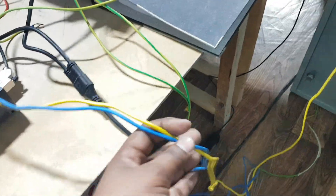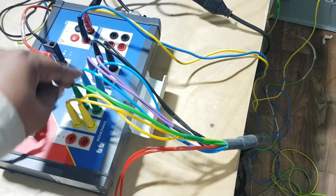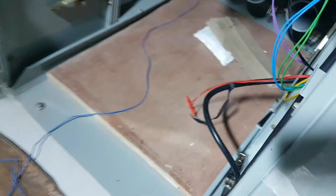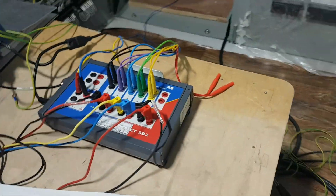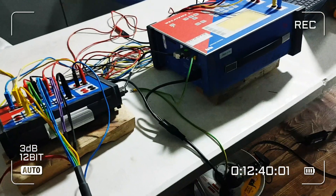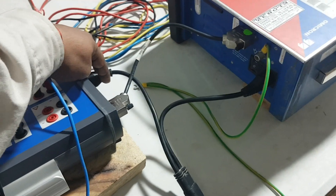This is the primary cable and this is the secondary cable. We are not using the sixth tap because our CT schematic is only five taps, so the sixth tap is left open. The other side's sixth tap is also left open. All other CT secondaries are connected here. Now we are testing this CT with the multi ratio test kit. For multi ratio, we have to switch on this power cable - one end connects here and the other connects here.